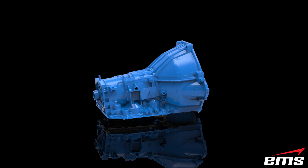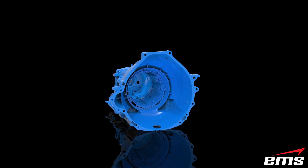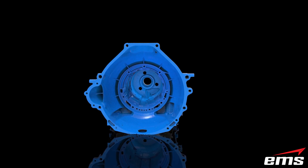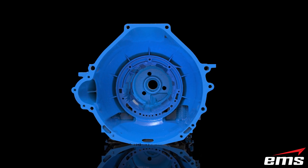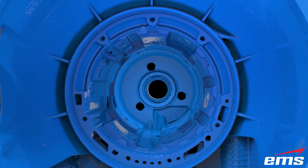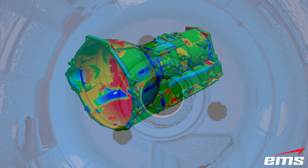So how does the data look? In one word: stunning. This data has not been massaged in any way — it is directly from the 3D scanner. There was no hole filling, smoothing, or other manipulation. Other systems are now using artificial intelligence algorithms to clean up their models, which is absolutely unacceptable in inspection and metrology. You want good raw data right from the scanner, not highly edited data because of the scanner's inability to accurately scan challenging surface types or fine features.